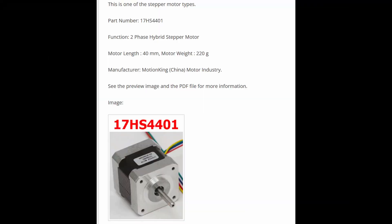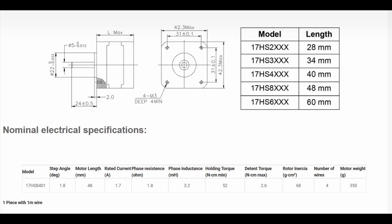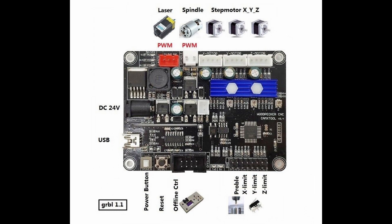The first modification is the stepper motor. I changed the original stepper for the NEMA 17HS4401 for the X-axis, and the NEMA 17HS8401 for the bed Y-axis. This stepper has more power. The problem is the original mainboard was made for a driver current of 800 milliamps, and this motor has a rated current of 1.7 amperes. The heatsink and the fan are not designed for these currents.